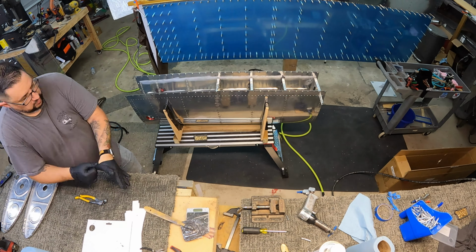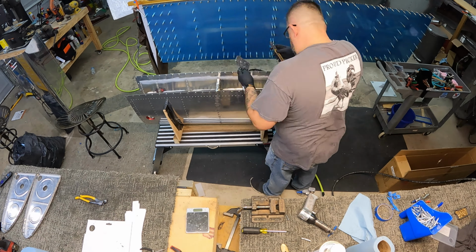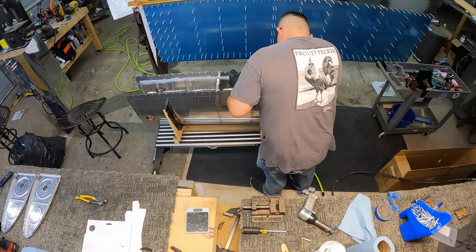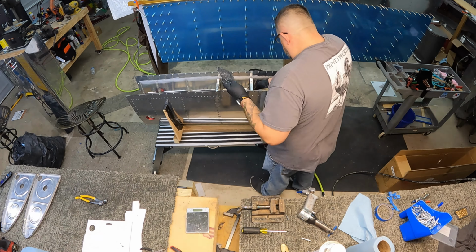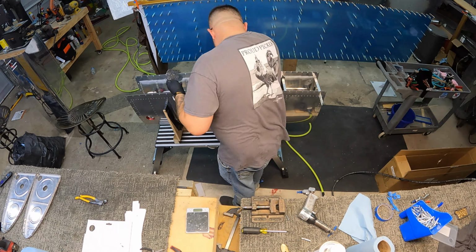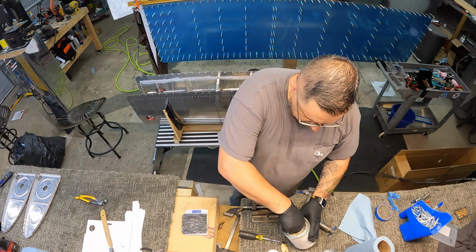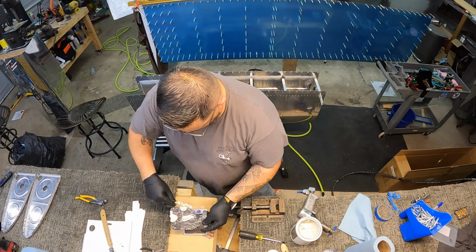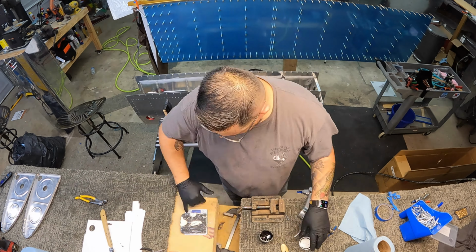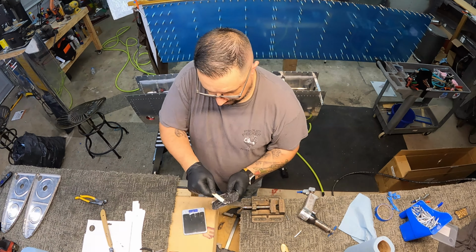More gloves, because I need to mix more sealant. I'm using what little I've got to try and finish those fillets, but I'm pretty well scraping that palette for what little I can get off of it now. Also, doing 2 at a time, it made it more difficult to get to the fillets than it needed to, so do one, finish the fillets, then do the other one. So I think for this I just mixed up another 30 grams just to finish the fillets and do the caps.